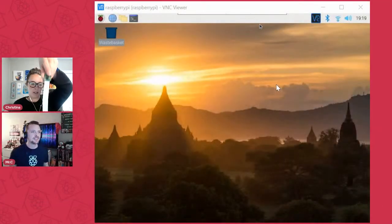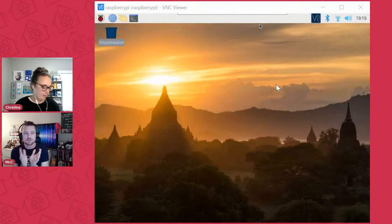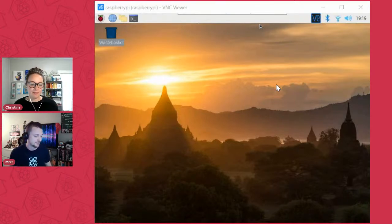That's it. Perfect. So now that you've got that, you can power up your Raspberry Pi. Don't ever connect your camera with the power on. That's the best way to kill cameras. We used to run workshops and we lost loads and loads of cameras to not having them connected properly, or not having them disconnected properly. So do be careful with your camera boards. They are sensitive bits of kit.